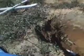Now the way we do that is we take this piece of 3/4 inch Schedule 40 PVC. You can see I've already got it primed. It's very important to prime all your connections because the PVC pipe will have oils and stuff on it, and the way this glue works is it actually melts the two pieces together, and so the primer basically strips off all the junk that might be on the pipe, so you get a nice solid connection. When you do that, the joints are actually more solid than just the regular piece.